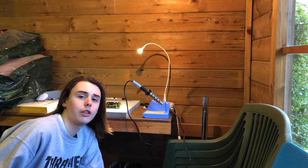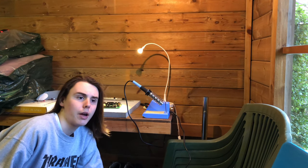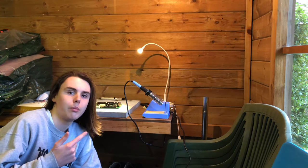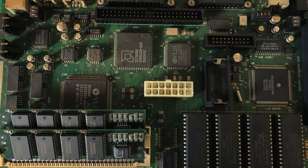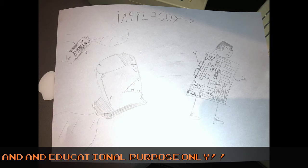So I finally finished cleaning the board. It really paid off, most of the corrosion is gone, and in my opinion it overall just looks great now. For now, I'll just clean the backside of the board one more time with a soft toothbrush and some isopropyl alcohol, and then start soldering. The leaked electrolytic goo or electrolyte from the capacitors starts eating away the board.